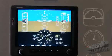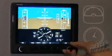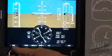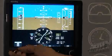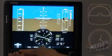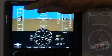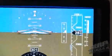There are dedicated course and heading knobs, so the pilot can quickly set his heading bug just by turning the knob or the course indicator. There is some added functionality — if you press the button, you can cycle through a menu. You can dim the unit, set your course, and set your indicated airspeed bug. Over here, you can set your baro setting so your altimeter setting can be dialed in right here. Your altitude bug can be set, and then back to a course knob as well.